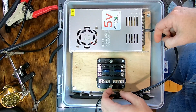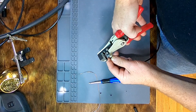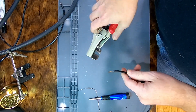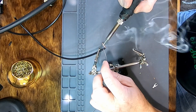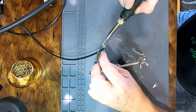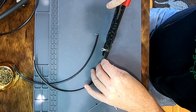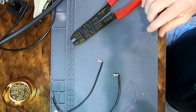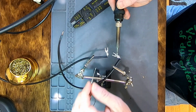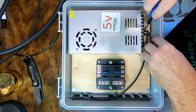Wiring time — I've moved to the electronics bench up in the ham shack slash office. This is 16 gauge low voltage landscape wiring, which works pretty well for this kind of application. There is fairly high current involved, so I'm going to run two strands from the power supply to the fuse block for both positive and negative. The ends of each strand get stripped, tinned, and then have a spade lug crimped on. There's a 90 degree angle baked in here already because there's not a lot of clearance on the end of the power supply. Once the lugs are crimped, I go back and re-solder.